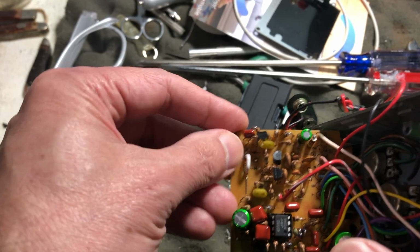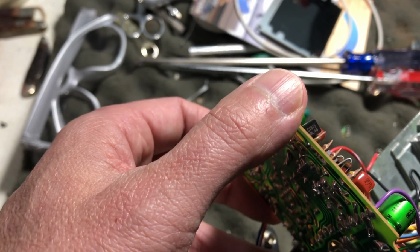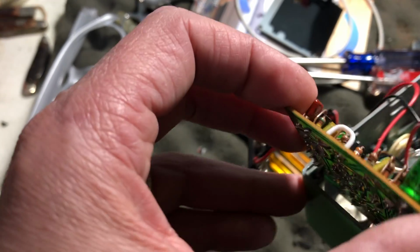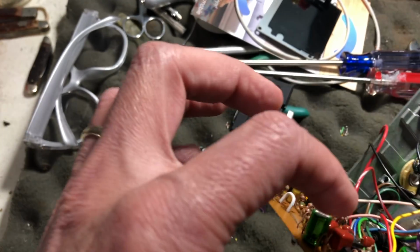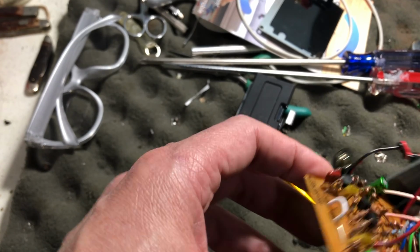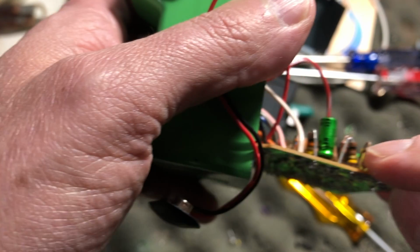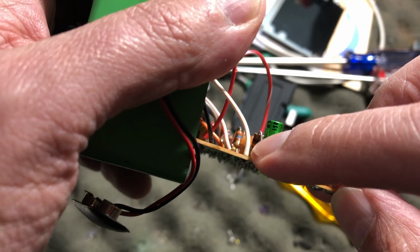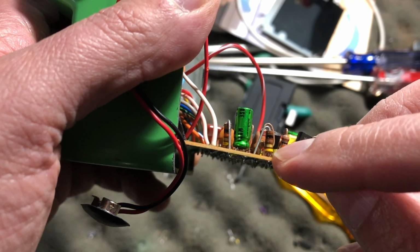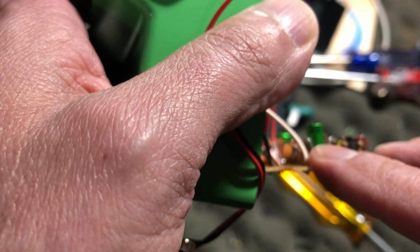And there's a jumper. Now for the 808 mod, you see the electrolytics have all been replaced with good Muse non-polarized or bipolar electrolytic caps, high quality. The 5-band Allen Bradley resistors for the 808 mod. These are carbon comp, new old stock, 5-band for higher tolerance. We don't see these all the time.